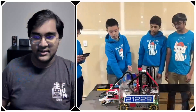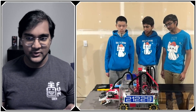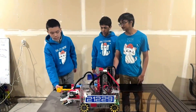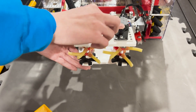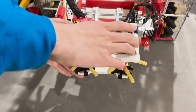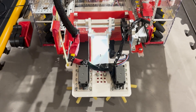Let's start with intaking for the samples. Walk me through exactly what you're using for the actuators there. I see some GoBilda servos — why go with that servo design instead of motors for that actuation? On our intake, we have two servos driving these noodles. We chose to use these GoBilda servos as it was simple and lightweight for our robot. We didn't want to use a motor to gear up these two noodles, as using servos was the most simple and efficient way we could get this intake working.